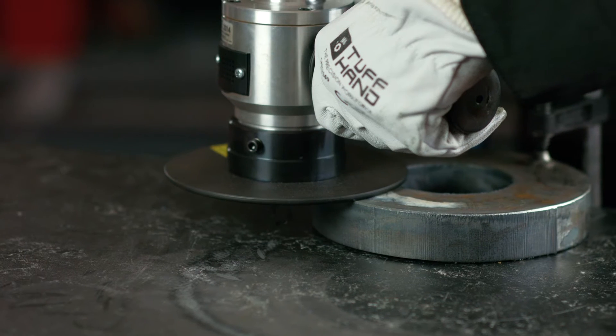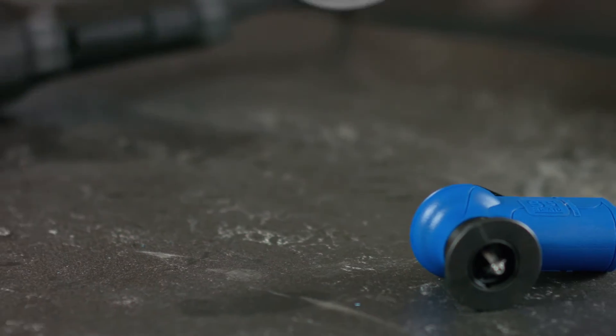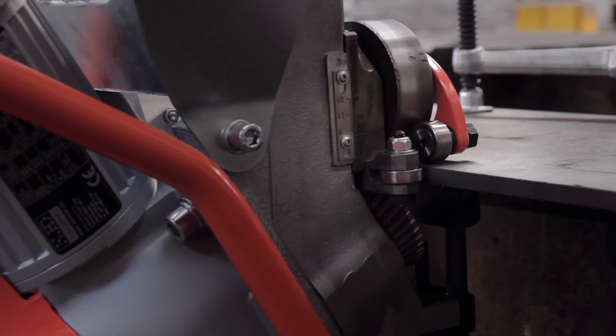The question is: what are the pros and cons of automatic versus manual beveling, and how do you choose? Automatic beveling is almost always the best solution. However, sometimes there are budget limits and a manual beveler may be a better low-cost solution for smaller jobs. Generally, bevels of over 10mm are very difficult and require a lot of manual effort to push the machine along the edge. In these cases, an automatic beveler like the UZ-12 is a great solution.